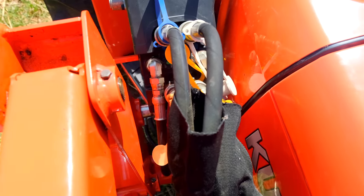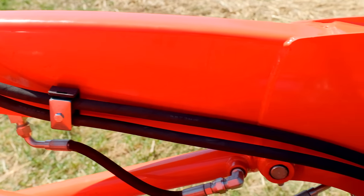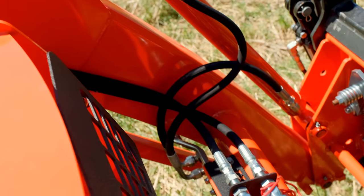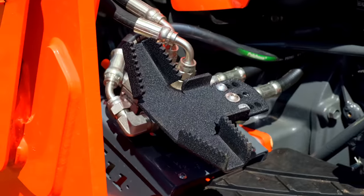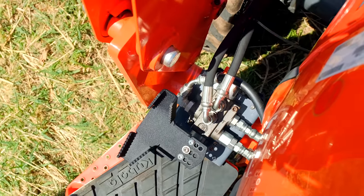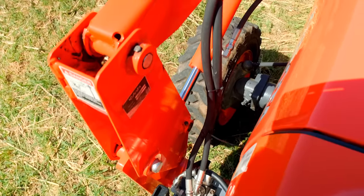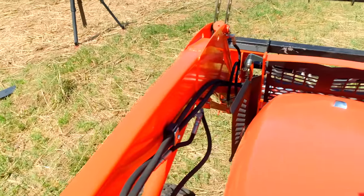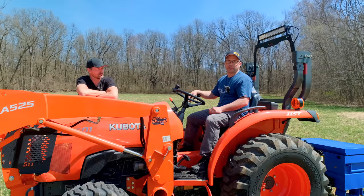There's a few selling points that I'd like to mention. Not only the lack of solenoids and electrical, you also don't have to wire those things in. This is just all hydraulic installation. Also the speed. You can control the speed just by feathering this slowly, fast. With an electrical one, it's wide open like a light switch. You hit it wide open, hit it again, close. So this gives you a little more control, and there's really not much of anything to go wrong with it, aside from maybe the internals of the valve itself wearing out.